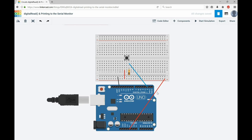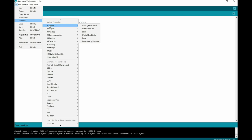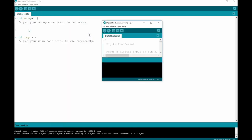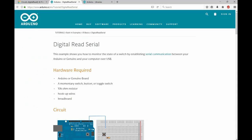Now let's open up the Arduino IDE and jump into the programming. If you go to File, then Examples, then Basics, you'll find the digital read example. There's the blink we did earlier, and this is the one we're going to do right now: the digital read serial. This example code is in the public domain, so everything is available. There's a sketch from Fritzing on how to hook it up — basically the same diagrams I showed you on Tinkercad.com.